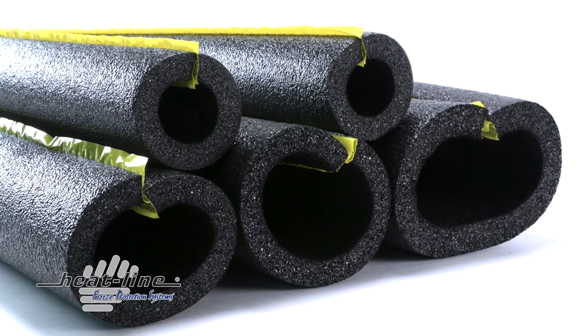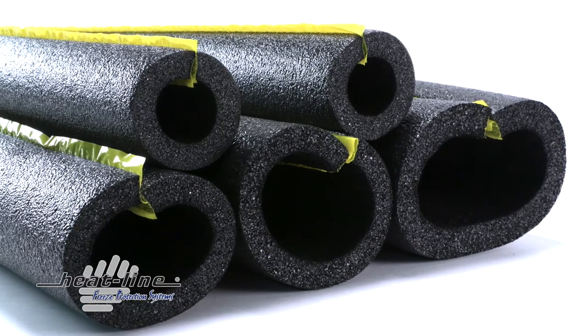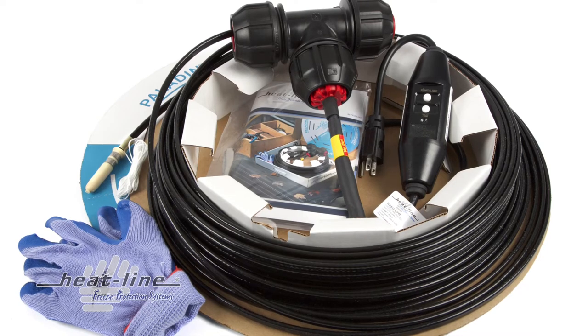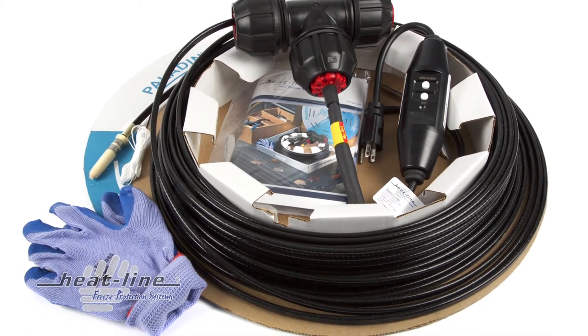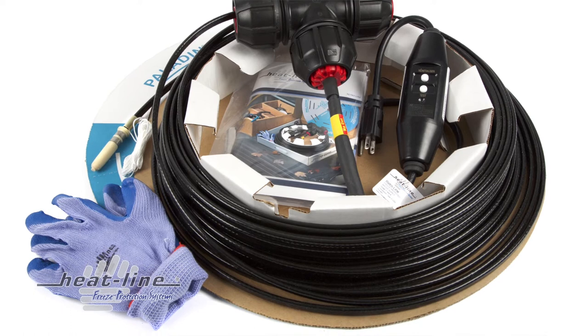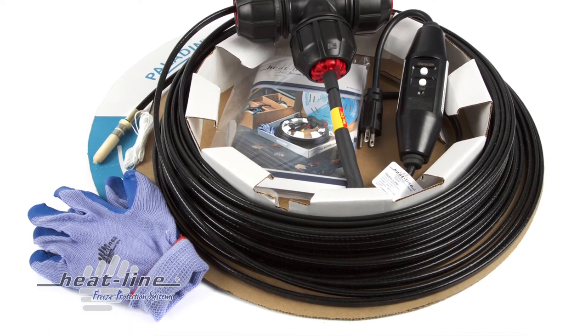RetroLine can be installed, operated, and is certified for installation in metallic and non-metallic pipes. One of the most important features of all HeatLine products is that they can be fully insulated to optimize and increase energy efficiency. All HeatLine systems can be installed above the ground in the most severe climates and they will not freeze provided they are fully insulated.